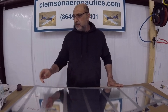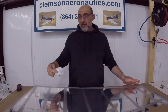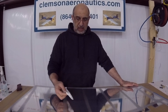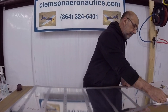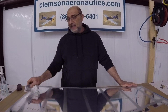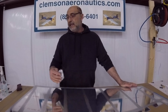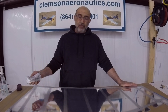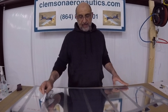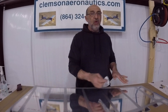I just finished scuffing over the holes and sprayed isopropyl alcohol on there, then cleaned it up with a towel. After I finished, I noticed that the dust from what I scuffed scratched all over the skin. Since the clad is so thin, I'm just going to go ahead and paint the entire thing from the inside — I'm not going to scuff the whole thing. It's self-etching primer, so it's not going to add that much weight — an ounce at the most. I'm just going to prime the whole thing from the inside.